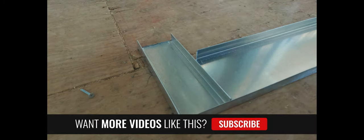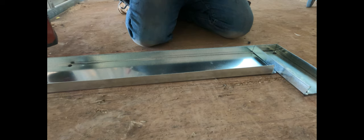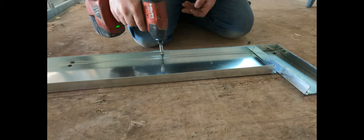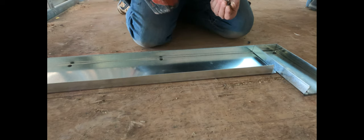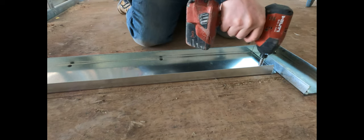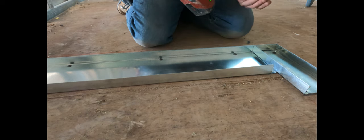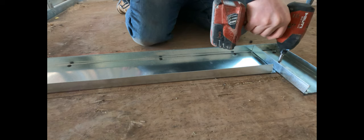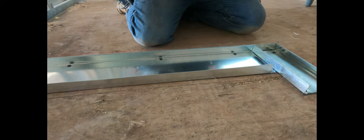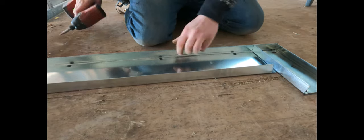You can also see that the stub is the swing of the door — normally the door swings that way, but in this situation it's a pocket door. Because we have a wood floor, I'm using fine-thread wafer screws, going every 10 inches on both sides of the track — it's super strong. I love overlapping all my corners as much as I can; it gives the whole build a lot more strength.